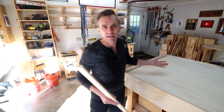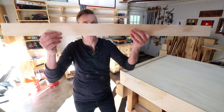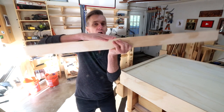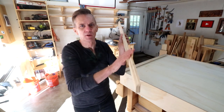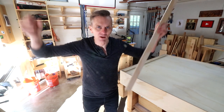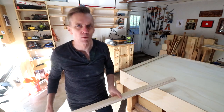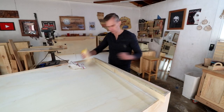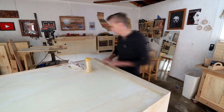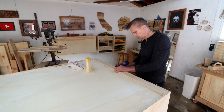So instead of leveling the cabinet, which is really difficult on something this big, all you need to do is level this cleat on the wall, drop the cabinet in place, and because of that 45 degree bevel, it actually gets tighter the more weight that goes on there and more firmly attached to the wall. I'm attaching this solid strip with no bevel to the bottom of the cabinet. This will just fill up that recessed area so that I can drive a couple of screws into this to further stabilize the cabinet.